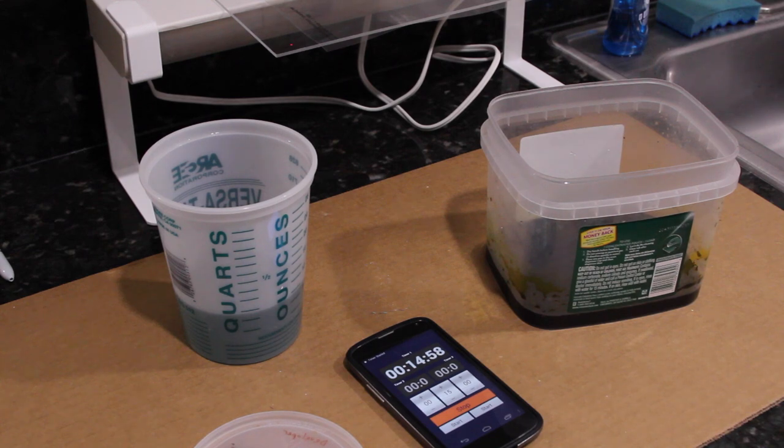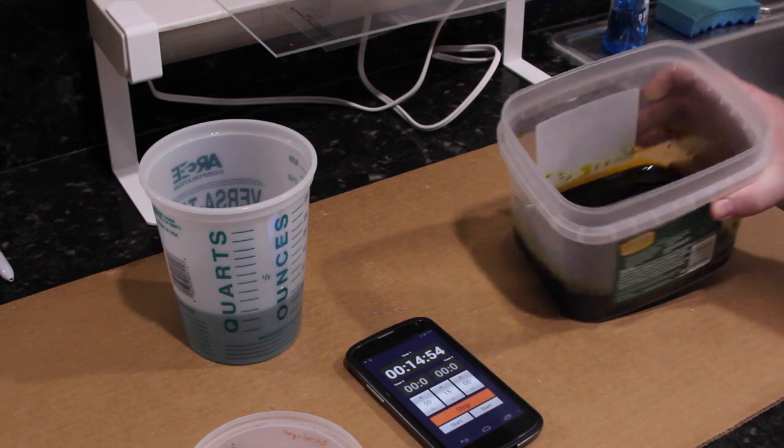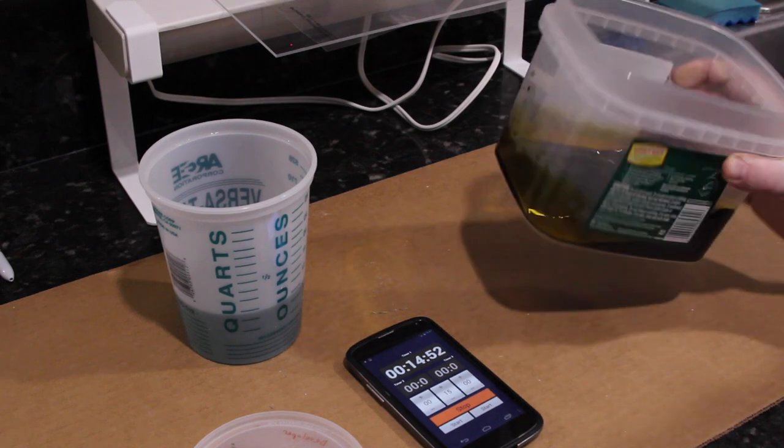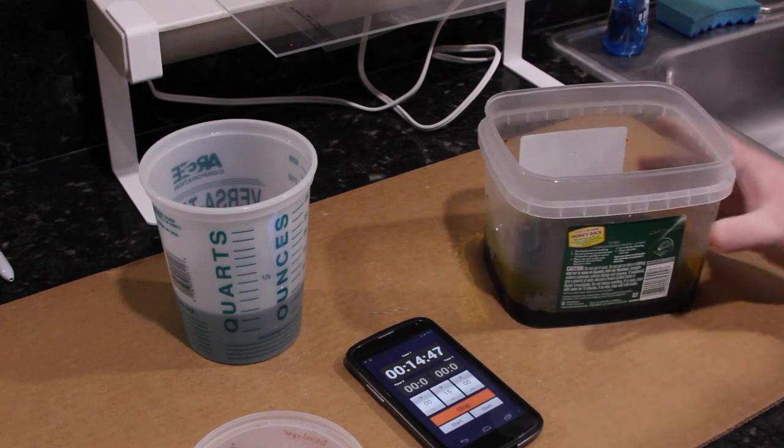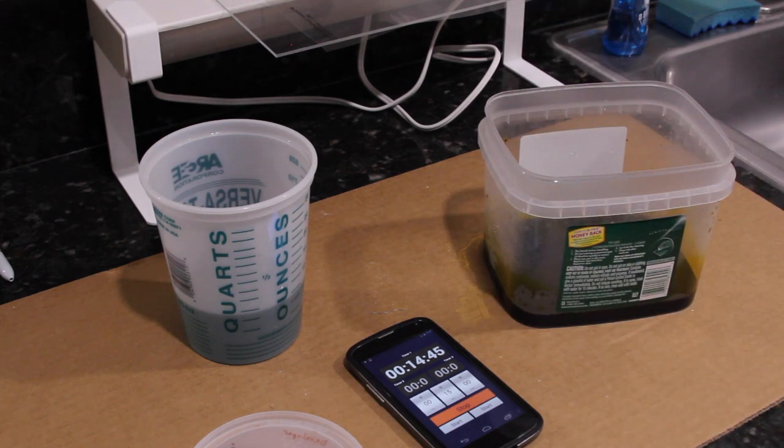So it's already been 15 minutes, and we're only about halfway done etching, and that's kind of my fault. It would have really helped if I heated up the ferric chloride, and more importantly, this ferric chloride is worn out because I've used it to etch quite a bit of stuff. So it's probably going to take another 15 minutes to etch. I'm not going to bother recording another 15 minutes of this, but I'll show you what it looks like when we get toward the end.